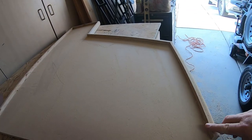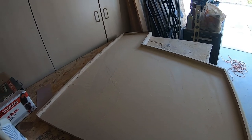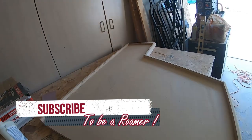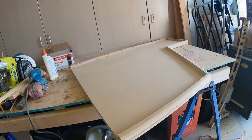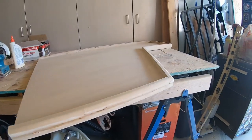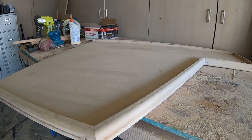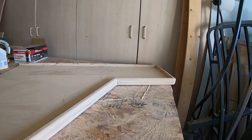As you can see, I ran all my strips on the bottom to be able to create my bull nose for the countertop. I got them all glued on and nailed, and I have routed those, so I created my profile. What I did is I rounded it over with a half-inch round-over bit, so it creates a nice rounded bull nose kind of look.